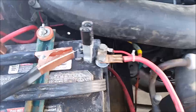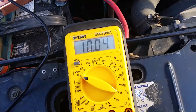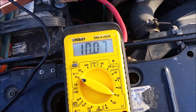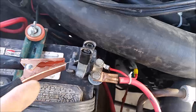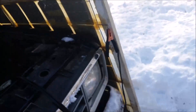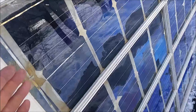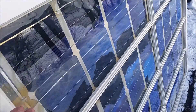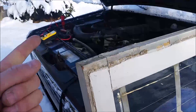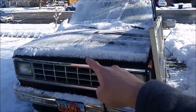No sparks — that's a good sign. The voltage is definitely increasing, which means we're getting power coming in. You'll notice I have a diode here. This keeps the electricity flowing in one direction only. This is necessary because when the solar panel is in sunlight it's fine — you'd need a potential difference of over 20 volts for electricity to go back through it — but when the sun's not shining, it basically turns into a big resistor, and resistors draw current off batteries. The diode in line stops it from draining the battery when the sun goes down.